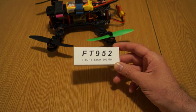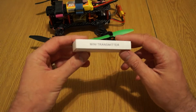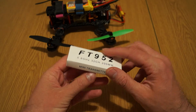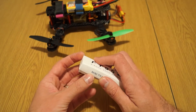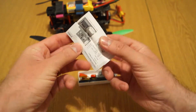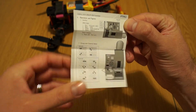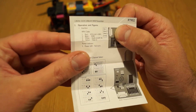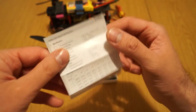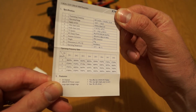To be honest, it's really, really small and tiny. I will just open the small box so you can see inside. It just says 'mini transmitter' and the specs I mentioned before. I will link the Banggood product page for it. It has some small instructions, which is basically all you need — how to set up your channels. It's really important: the socket, which pin does what. This is really important because most Chinese products don't have this information and you can burn your module. And here are the specifications and the group selection for each channel.